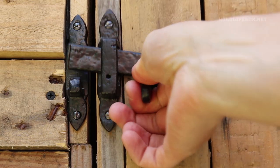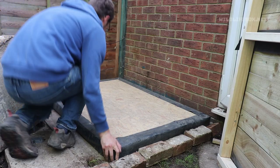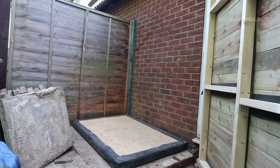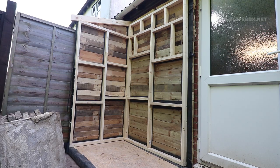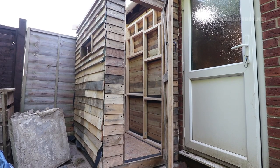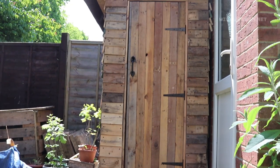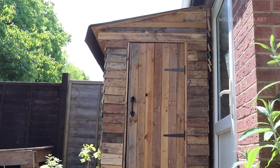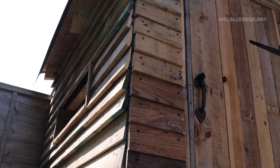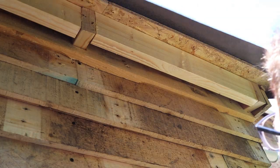Next I created a space outside for the bird hide. I used some old concrete slabs to create a level surface, then placed the base outside and then the other sides as well, placed them in position and secured them in with screws. I then put the roof on and to do this I used some roofing felt. I put it over the OSB timber with a little overlap which I then nailed down around onto the inside of the roof, secured it in place with clout nails, and added a timber which I could nail the overlap to.